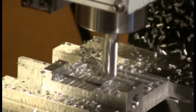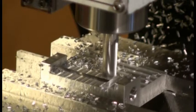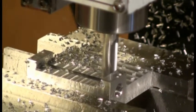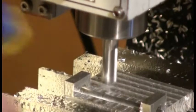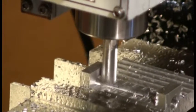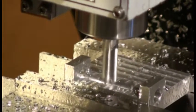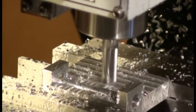You can also see the ears starting to form now. On the final pass — about 30 thousandths of an inch — it's actually one thousandth of an inch higher than the rest, mostly because I didn't want the end mill dragging around on the other portion of the part we just finished cutting. It doesn't really make any difference for my application, but I just don't like to have the end mill dragging as it moves.